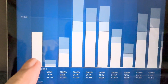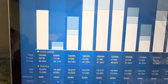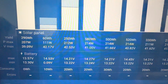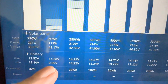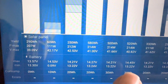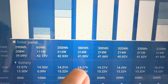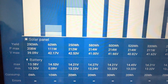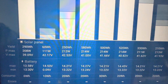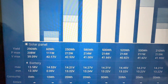Then yesterday morning — it was early, barely any power coming in off those panels. If you look right there, the minimum battery voltage — which every other day I've been using it, waking up the battery was just sitting there at 13.2 volts doing just fine, not really touching the battery at all for nighttime use — but yesterday it was 0.09 volts on that battery.